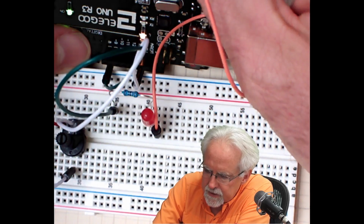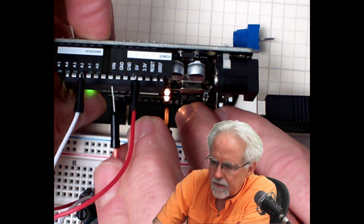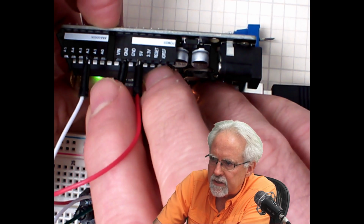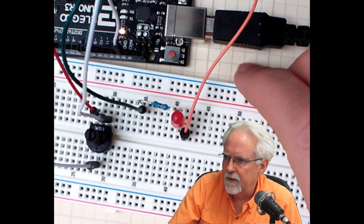And if you look, there's a GND up here. Okay, you see there's a GND right there. In fact, there's two GNDs there, so I'll put that like that. Okay, so I now have a warning LED in my circuit, and you can see how that's hooked up to pin 9, right? Let's come back over to our code.